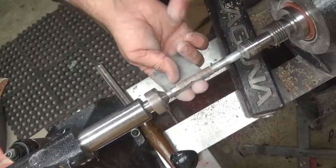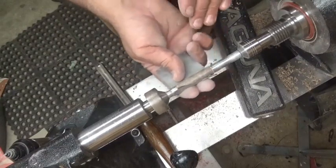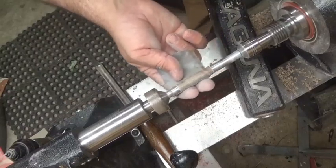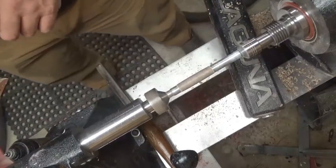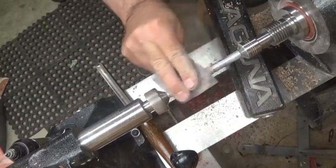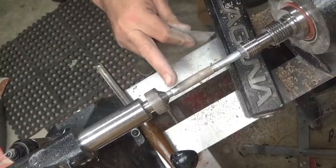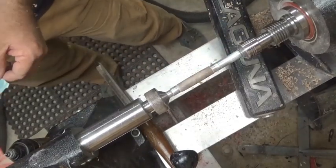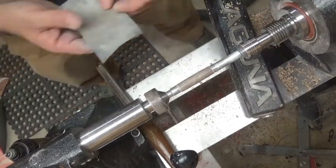I could use Yorkshire grit, but I don't want to use sanding sealer, and I don't want to get any wax or oil on it, because I'm going to be using a CA finish. So I'll try and get this as smooth as I can. That's 800. Again, go with the grain. Just a little bit. There's hardly any scratches. You can't even see them now. There's no scratches on there. Essentially, that's what you're doing. With every grit, you're scratching it finer and finer. This is 1200.